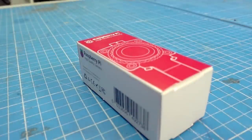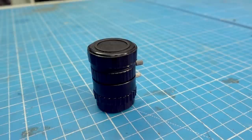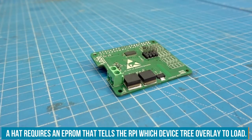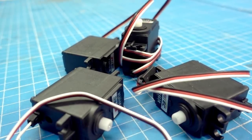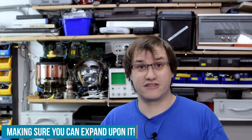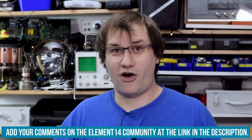I need a camera, so I'm choosing the Raspberry Pi high-quality camera with the wide-angle lens to get a good field of view for my robot. We also need additional hardware, so I decided to make my own add-on board for the Raspberry Pi. It has 16 PWM channels — we only need 4 this time — analog in, and an IMU. I want to expand that platform in the future with your ideas, so post them on the Element 14 community and we'll pick your cool ideas, build them, and share them with everyone.